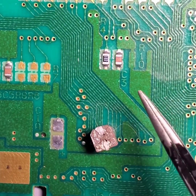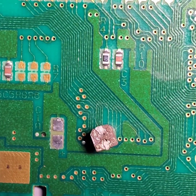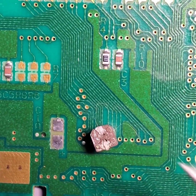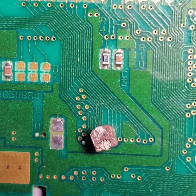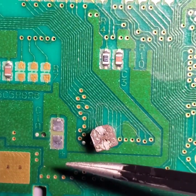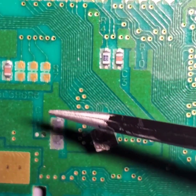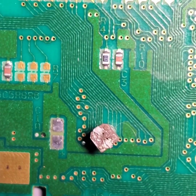But if you look down next to that resistor and that capacitor, you can see some white buildup around those components. And that white buildup is also left over from the capacitor electrolytic fluid leaking out onto the board, and from me trying to get that cleaned up with isopropyl alcohol. So in order to test those pads, we can scrape away the solder mask right up here above the pad where it leads off to, and then we can also use some of these vias down here for the other pad that links to it, and test continuity to make sure that we don't have a break on these traces from the pad down to the remainder of that circuit.